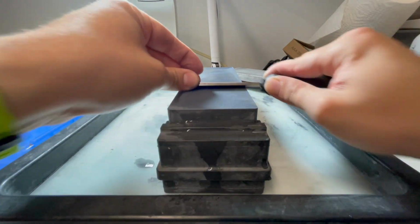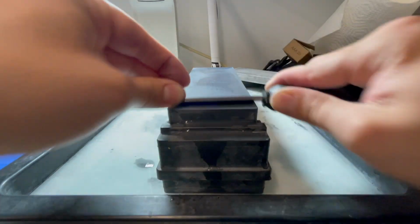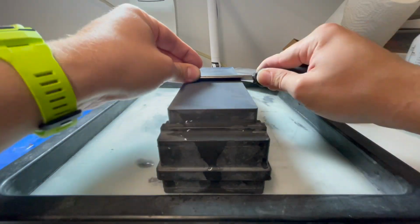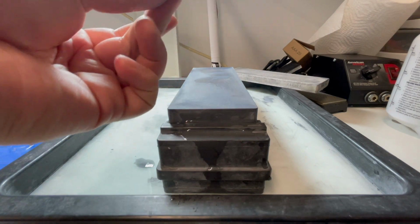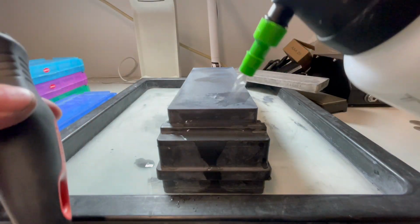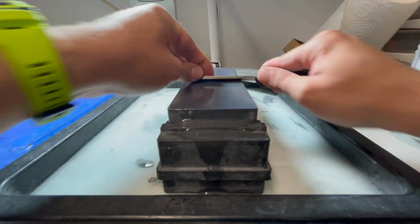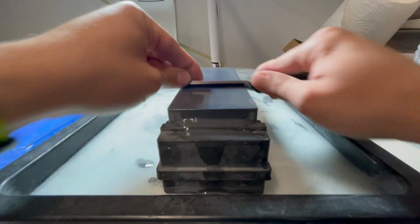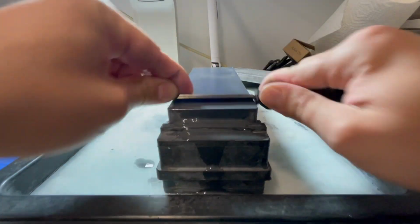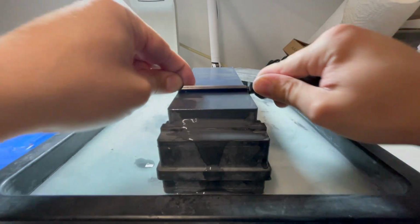You may say, well, why would you buy stones that warp? Buying stones like this allows you to cut very fast, cut through the steel. And part of that is because the stone is breaking down and the material is cutting the steel. The steel is getting slurried up with the compound from the stone, and it cuts very, very quickly. And you kind of have this balance where the stone doesn't break down as quickly as a Japanese water stone, like a yellow water stone. So you're trying to get the best of both worlds. It cuts fast, but it's not too hard to maintain. And you can always have that fresh edge.